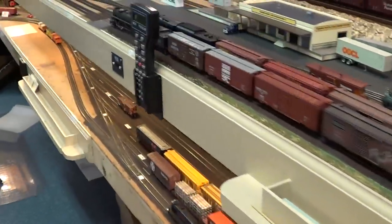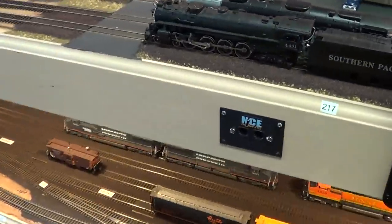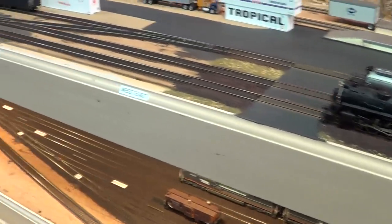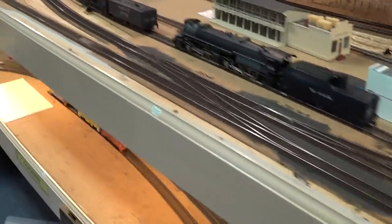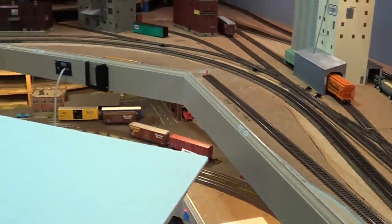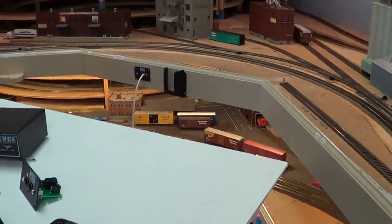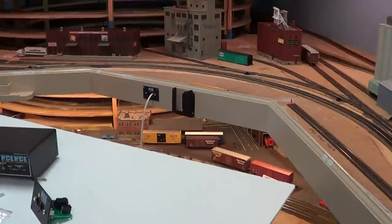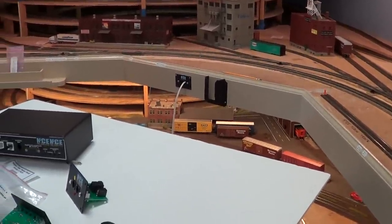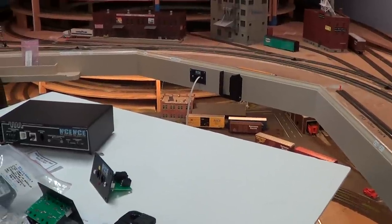Wall warts are designed just to add voltage, and they add it correctly. If you don't know what you're doing, you can get into a situation of back-feeding voltage into the command station, so you have to be real careful with this system. Again, from the Grande Pacific — hope this tip will help you.